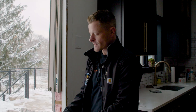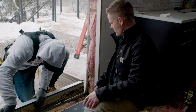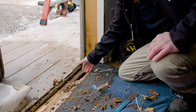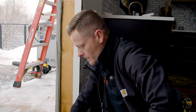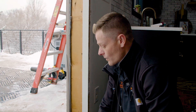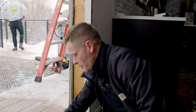Now that we've started taking the sill of the old frame out, we've noticed that in the bottom corners of that sill plate it's pretty much rotten. What we're probably going to have to do is cut up a little bit on the side studs, pull the floor sheathing off to expose the actual two-by-four stud, pull those out with a pry bar, and splice in some new wood so that the new door is sitting on nice clean wood before we wrap it in tape and flash it. It's going to be a little bit of a process.